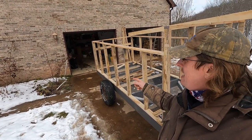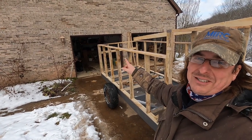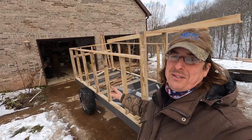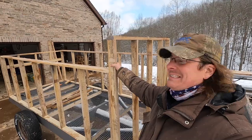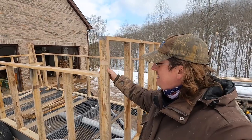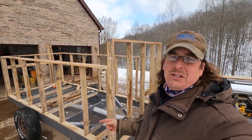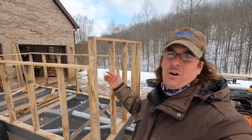It's a little bit lower in that corner because the whole frame drops. So I think that's definitely where we're going to put our downspout for rain catchment, on that end versus the other. So you can definitely have gravity assisted opportunities there. But other than that, very solid. I forgot to put that rafter board up there. Very solid, and like I said, plumb and square, as square as we can be with that back corner. So we're going to check out the rafters, and I like to visualize it so I can figure out exactly the overhangs I want.